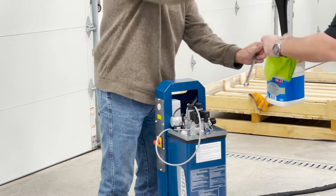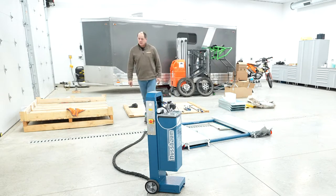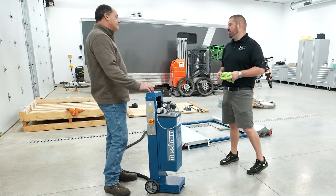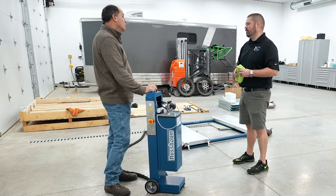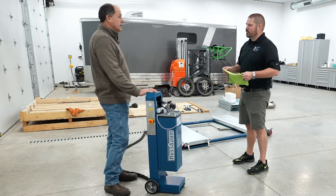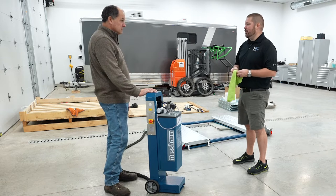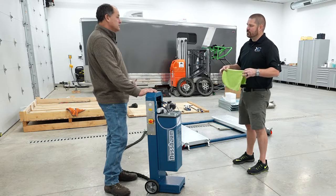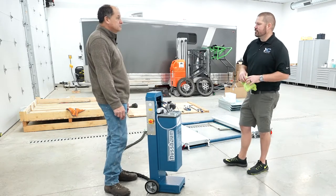That'll work. Go. What all lifts does Nussbaum offer? I think I've seen a fairly good selection: the sprinters, and the jumbos, which we've seen. Yes, the 7,000 to 9,000 pound jumbos, the full rise lift. Then you've got wheel-engaging alignment lifts up to 18,000 pounds. Each runway weighs about 3,500 pounds, so you're running heavy duty equipment on those. Two-post lifts go all the way from 7,000 pounds up to an 18,000-pound two-post lift with double jointed arms. They make a lot of stuff.